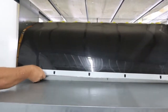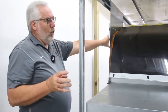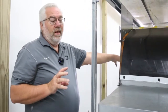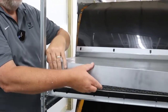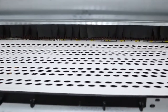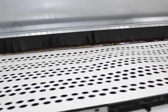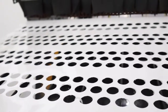It can be lifted out in one piece — no tools required. You can lift this up and simply crawl through it. The reason I bring that up is that when we work on the feeder or the watering and there's an issue, you need to be able to access it. While we're here, let's look at the egg belt as well — a nice wide 500-millimeter egg belt for the Plus, with holes. The holes keep the eggs from rolling around so they don't move on the belt as you go down the house.